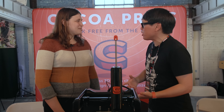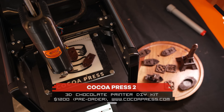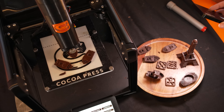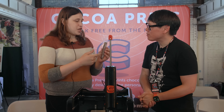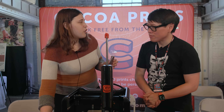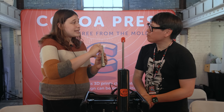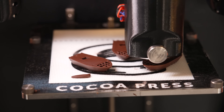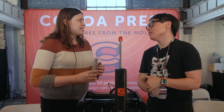Fundamentally, because we've worked with FDM printers for a long time, it's an extrusion machine. So I assume your X, Y, Z is basically like an FDM printer. Yes. What's different in terms of using chocolate versus filament? The main thing is temperature control. This is the filament that goes into the machine — it's a 60-gram core. They go into the stainless steel cartridge and are heated. There are two separate heating zones, plus or minus a tenth of a degree Celsius. Very precise temperature control.